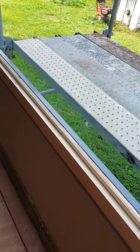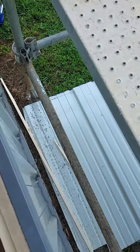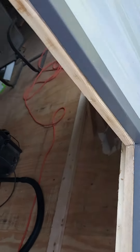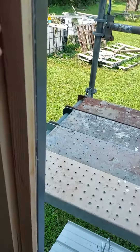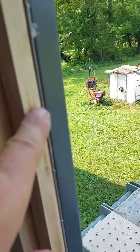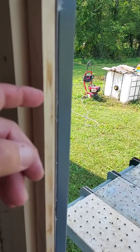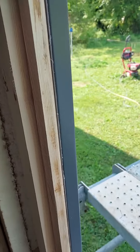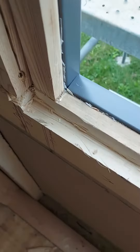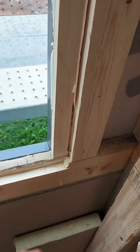Not that anybody's going to be installing one of these very soon, but just in case — you cut your siding out, put your J-channel in, and then you have to come inside, take a 2x4 and notch it. It's got to be 3/4 inch thick right here and an inch back. So you literally take an inch out and 3/4 this way. It's nice, it's simple, and you fit them all together — that's where the window nails in.